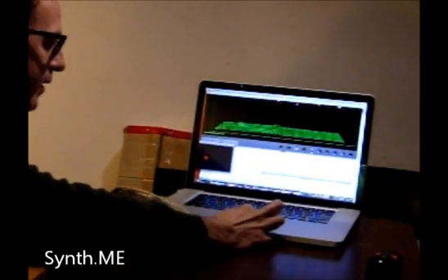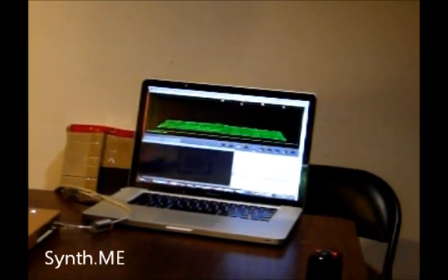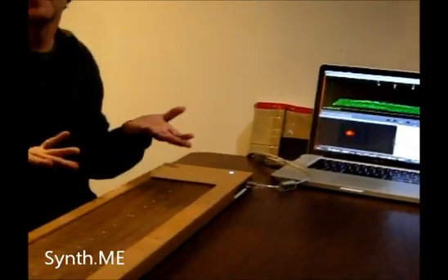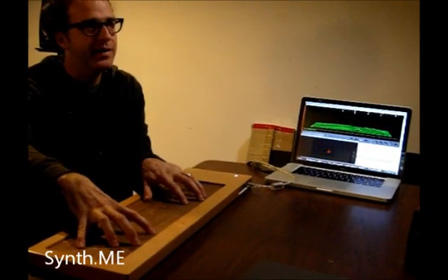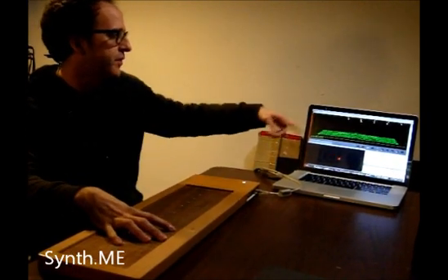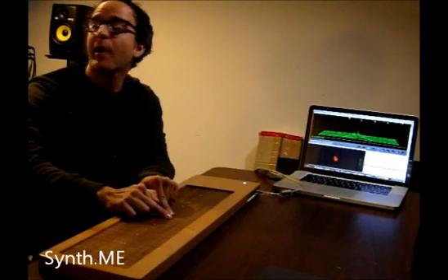This application is turning the pressure data at 8 by 64 points and boiling down this ocean of data, figuring out what clusters of pressure readings correspond to one touch of a finger. Furthermore, it determines what is the X, the Y, and the Z location of that pressure data. A lot of people ask how many touches you can do, and it really depends not on the software but on the physical layout of the device — the restriction is how close together two lumps can get before the software can't tell them apart and they become one lump.